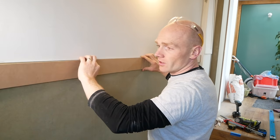Right, now we can test fit the verticals. I've cut these a bit long so we can creep up on the joint. That's about a millimeter off, same there. Yeah, so about half a blade's width to nip off those. Take 4, shorten those, and get them put in.